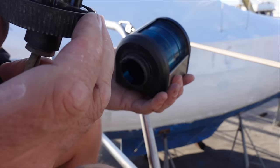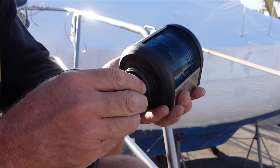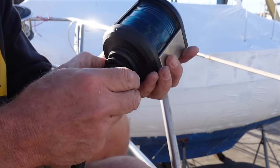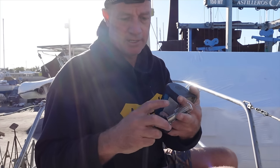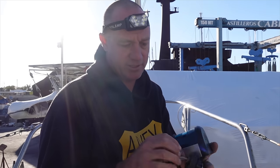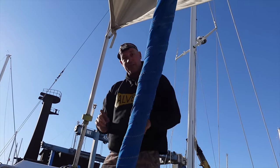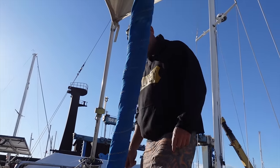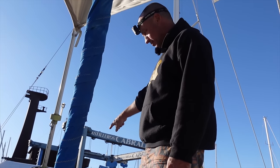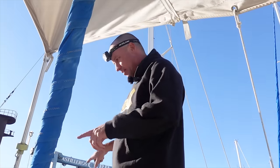These are Aqua Signal nav lights — pretty standard, been around the industry forever. Apart from all these external joints that were corroded and rotten, I'm going to run the cable straight up inside the boat so there'll be no external joints. One downside of these lights is that they're incandescent — I can switch the bulbs out for LED bulbs for a more efficient setup, but for now we'll just wire these up. Instead of external joints that let water in, I'll unscrew the fitting and hard-wire straight in — no joints.